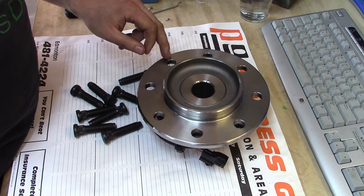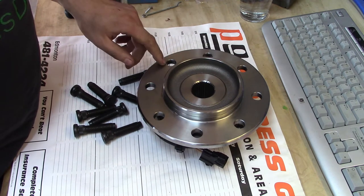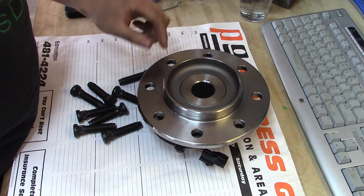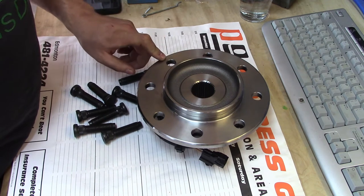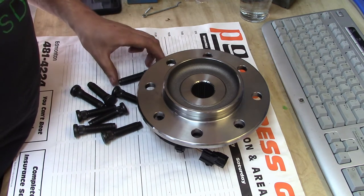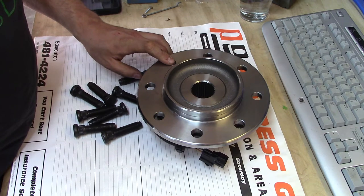What I'm going to do is a little bit of lathe work first so I can make a locating taper pin — a 5/8 on the one end that goes in the mill collet, and a very gradual taper so I can locate the center of the hole. It'll be within a couple thou, and that'll be close enough for what we're doing. I have material to do that with over underneath the mill.